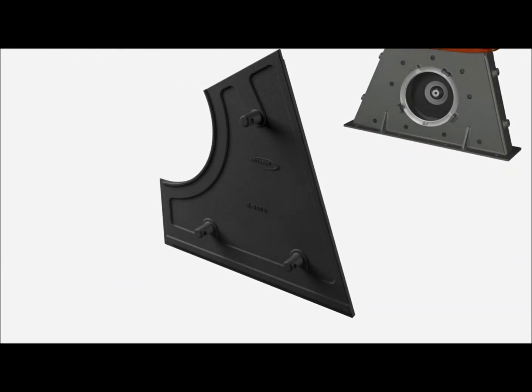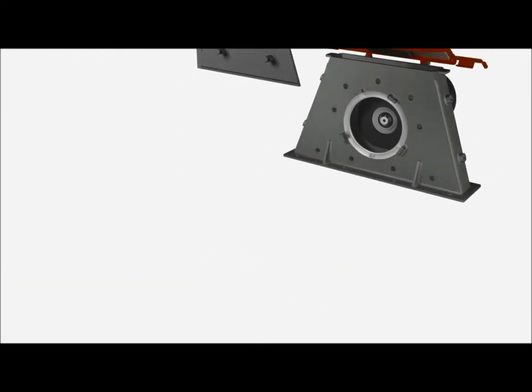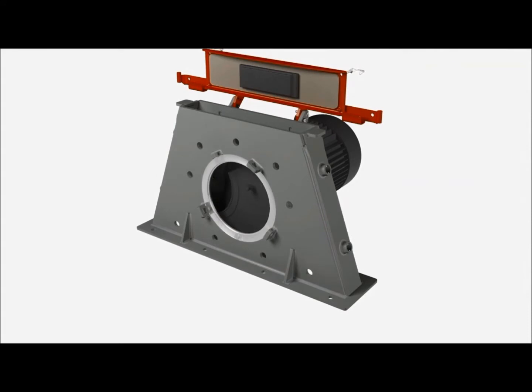The M4 housing, in addition to being constructed from abrasive resistant and manganese steel, is lined with our premium M cast chrome iron liners for even the most difficult applications, including hard grit. The side liners use an exclusive threadless cast post with a simple yet effective spring washer and locking pin arrangement that eliminates all threads.